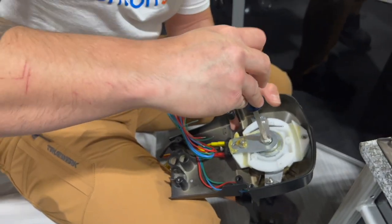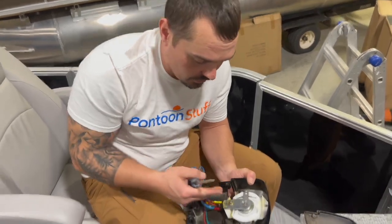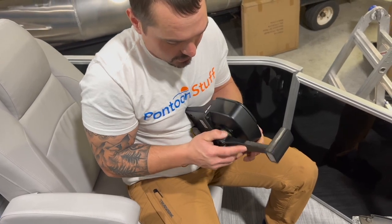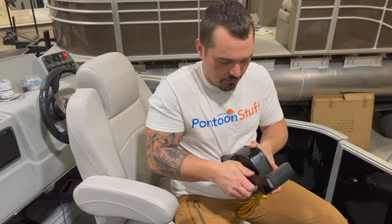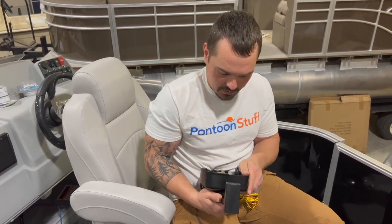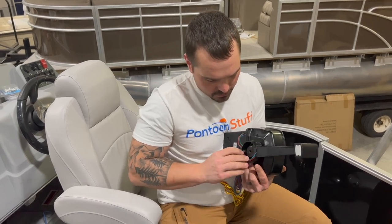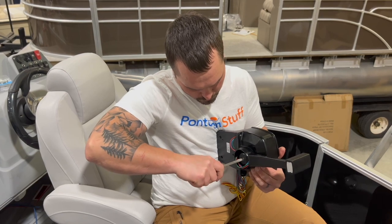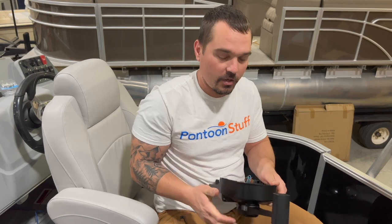I'll take my flat screwdriver and run this back in — watch that spring. Pretty straightforward adjusting from a push throttle to a pull. Now I can orient my shift handle where I want it. We're going to go straight vertical with it. Before settling on that final spot, make sure that when you shift it returns back where you want it, because you might find it's a little farther back or forward than you like. Get it centered the best you can, pull that extra slack back through from the trim and tilt wires, then put the set screw back in and the cover on — everything back together oriented the correct way.